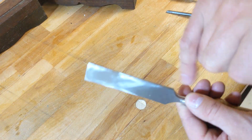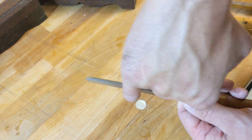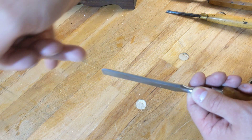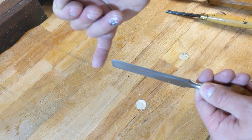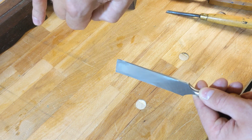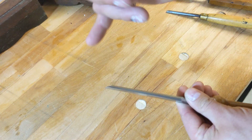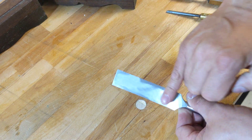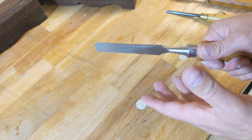With sharpening, when you're checking for a burr you've got to be careful to make sure your finger moves this way and away - it can't come this way or that way to check for a burr. If you do, you're introducing your finger to a cutting edge. Moving this way it's slipping away and you can sense for the burr - same that way, follow that angle off. But you can't come in this way because you're going to cut yourself.